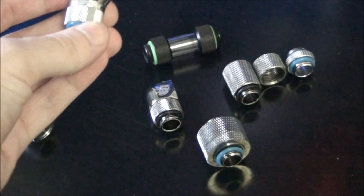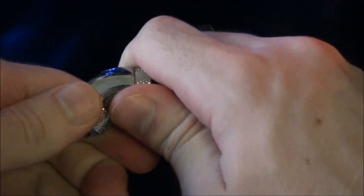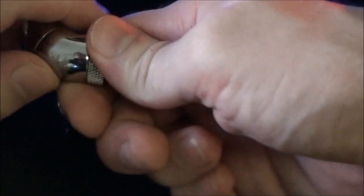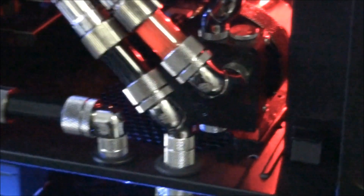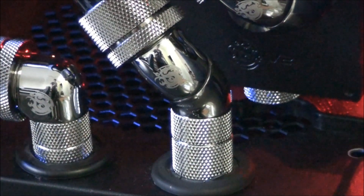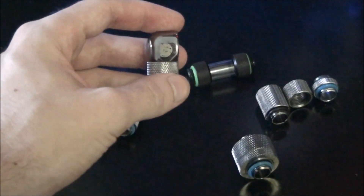This fitting is a 45 degree — it's a dual rotary fitting, so it rotates in two spots. Actually, I think it might be a triple rotary, so it also rotates here as well. I'll show you where that type of fitting can be used — it can get you straight around a corner like that, or it can be used like that. So that gives you really a lot of options. That's a single rotary 90 degree elbow fitting — it keeps things close and more compact.